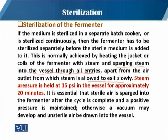The time is very critical, as we know when we sterilize the body vessel along with the medium. But in this case there is no medium, so there is no probability of nutrient loss because we are just sterilizing the body vessel of the fermenter separately. It is recommended that using steam we maintain the pressure at 15 pounds per square inch, which maintains the temperature at 121 degrees Celsius, for approximately 20 minutes.